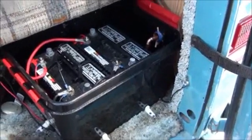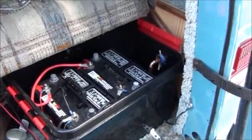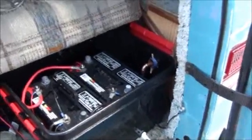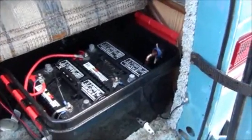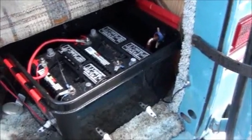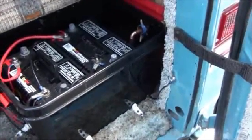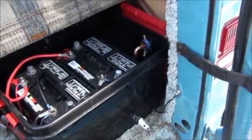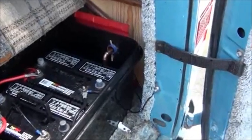On the safe side, I read online the most optimum way to vent the battery box. There are a lot of wrong ways to do it taken from old heating, air conditioning, and ducting practices — where you vent fresh air from the bottom and gas out from the top. That's absolutely wrong according to the website I studied. The biggest mistake people make is using PVC or plastic vent tubes, which won't work very well, if at all. You have to use copper, aluminum, or any non-sparking metal.